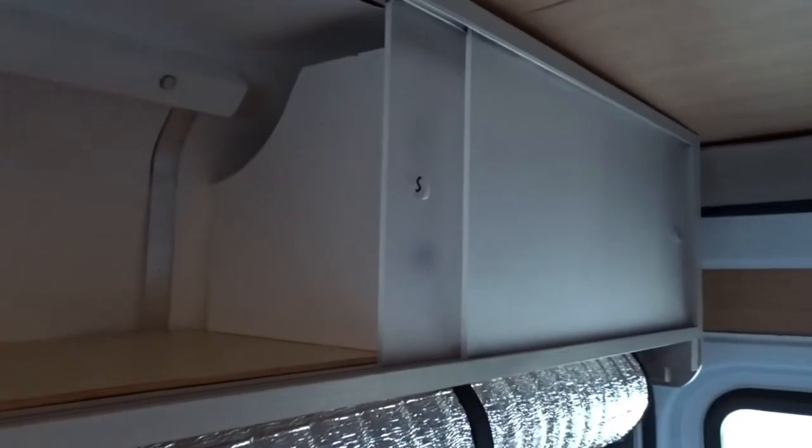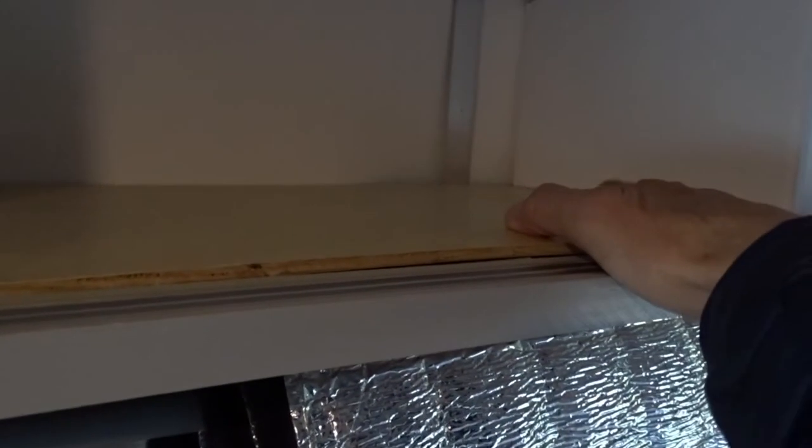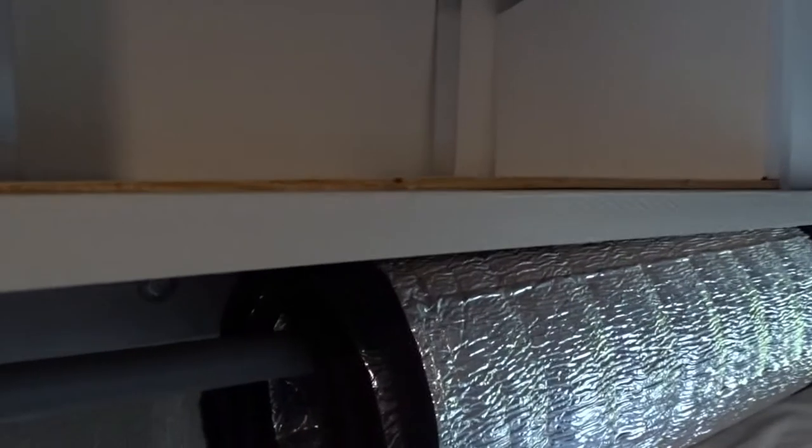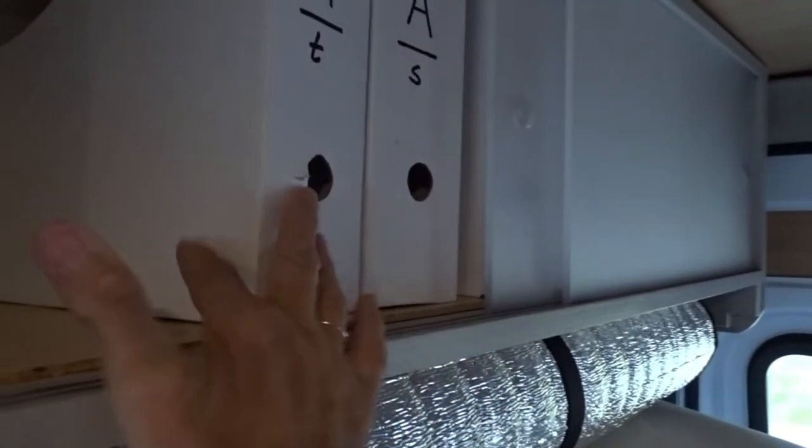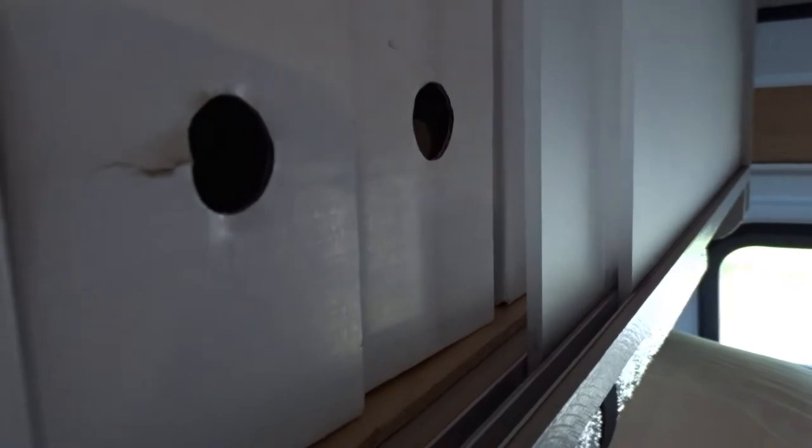As long as you have a sturdy base with 2x4s and 2x2s, everything else can come together. This is our closet for the bedroom. I just have a thin piece of quarter-inch plywood because the clothes don't weigh a lot. Betsy has a fabulous system of using magazine folders — she just cut down the top so they'd fit in there, and that's where we keep all our clothes. We have plexiglass doors that keep it all nice and tidy. They're 3/8-inch aluminum tracks that you can get at Lowe's or Home Depot, super easy to cut with a hacksaw, and the quarter-inch plexiglass just goes right in them.